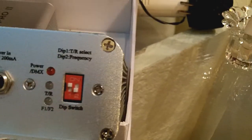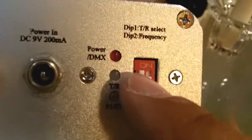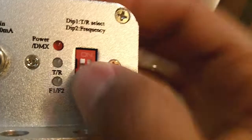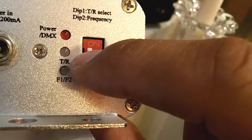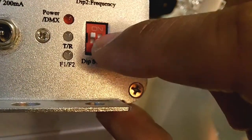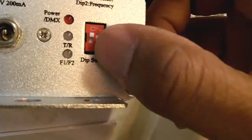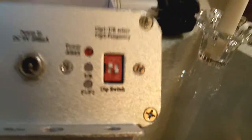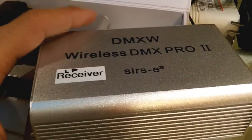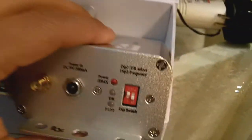These are your little data activity lights. This set has two jumpers with two dip switches. The first dip switch — if it's in the up position, that will be a receiver; if I flip it down, it's a transmitter. So I have these set up as receivers. The second switch is for channel one or channel two, because this has two different frequencies. I have six of them: one set as a transmitter and the other five all set as receivers, all set to the same channel.